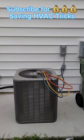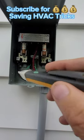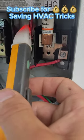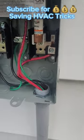Go outside, locate your condenser, and disconnect it. Then all you need is a simple electrical tester. If there's no power, go check your breaker. If there is power, change the fuses, and if there's still a problem, check your contactor on the condenser unit.